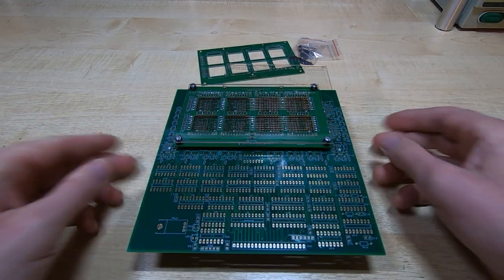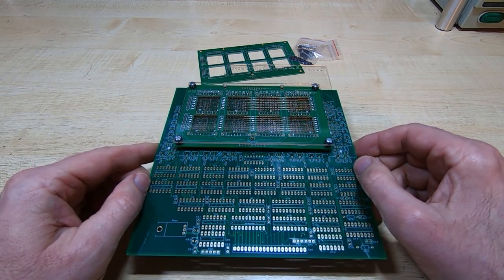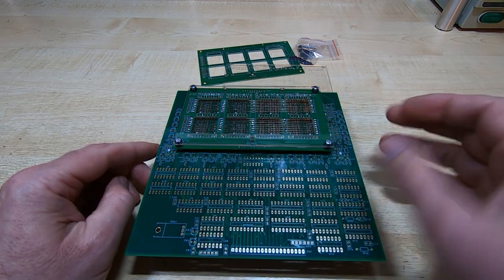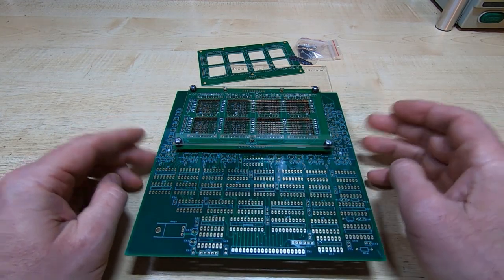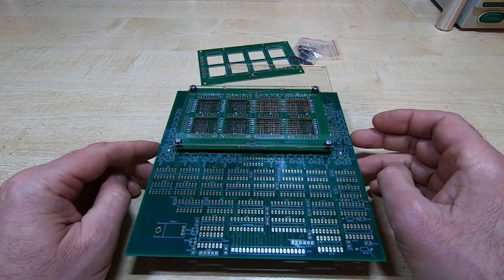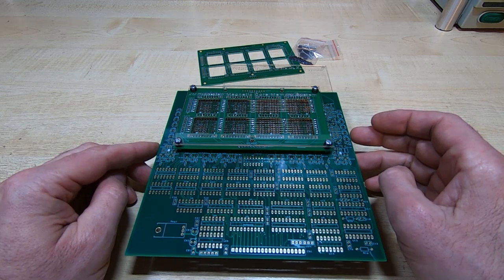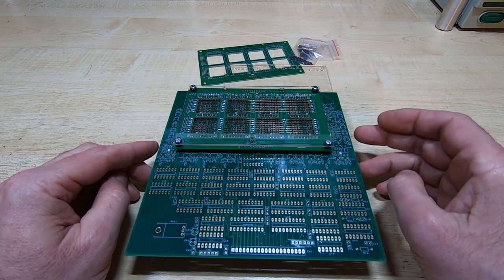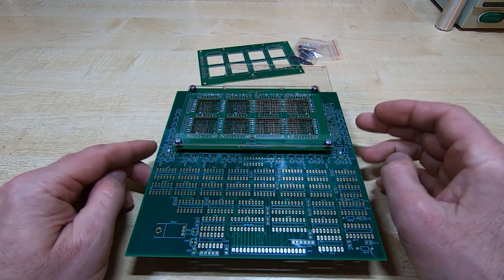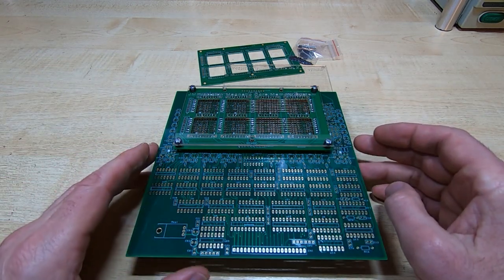So that's a brief explanation of the kit and what it will contain. The rest of the parts you will need to source from wherever you can find them. The ICs are all TTL ICs — all 74-series — and the discrete components are readily available bipolar transistors and resistors. All the capacitors are fairly standard values, so nothing strange there. All the parts that you'd have a problem finding — the board, the array, and the cores — I will include in the kit. I don't have a final price yet, but as soon as I know what it'll cost for all the various parts I will let you know.